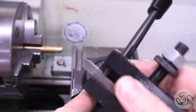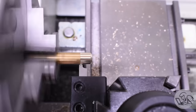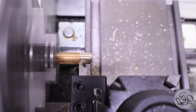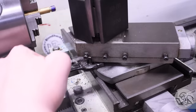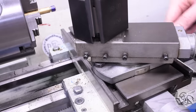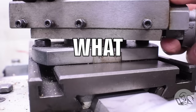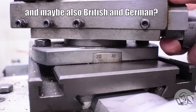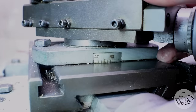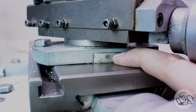Let's step up our game on prepping the stock. I'm going to use a round-nosed tool to create a relief groove. You want a round-nosed tool here and not a grooving or parting tool, which would leave square edges that create stress risers and weaken the thread. Make a nice curved groove at the base that's a little bit deeper than the minor diameter of your thread. Now we're also going to step up by learning about the role of the compound. Go ahead and set it to — and here's the number one most important thing nobody ever tells you about Chinese lathes: they typically have the compound markings 90 degrees off from American lathes. So don't set it to 30 degrees — you want to set it to 60 if you're using a Chinese import lathe. If your thread comes out looking like saw teeth then the angle wasn't correct, so try the other setting.